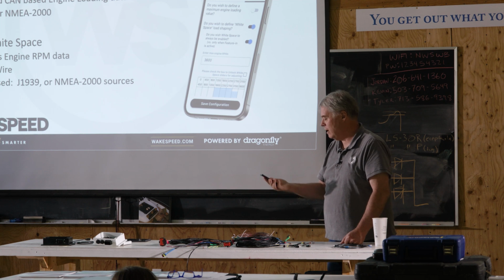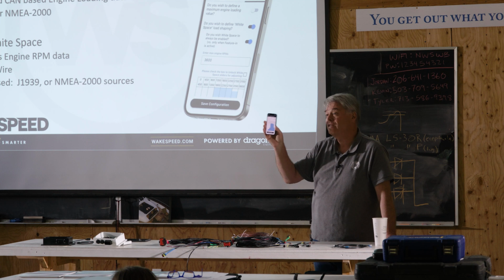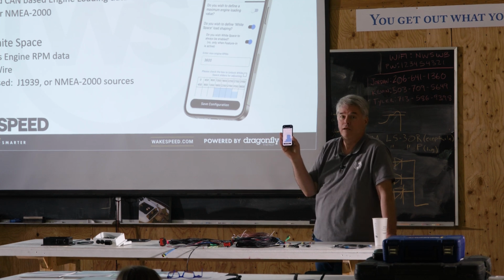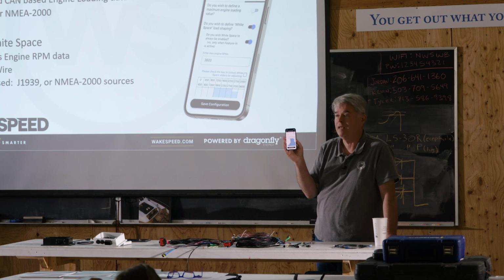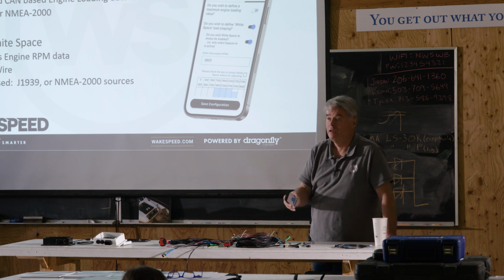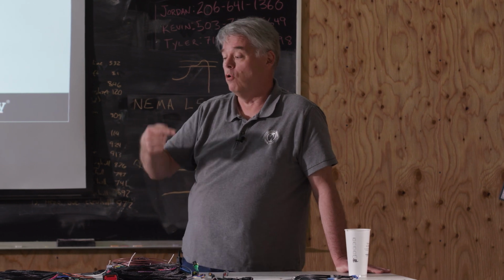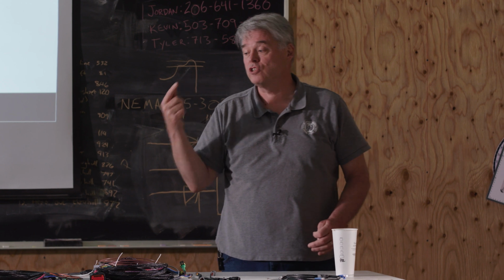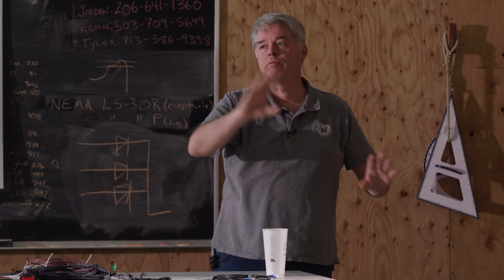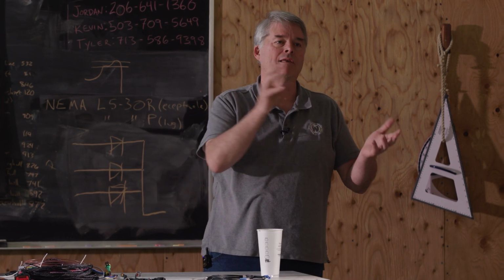And what this means, like here, I'm showing 10% for the lowest RPM. This doesn't mean that the regulator only drives the alternator at 10%. What it means is it's only going to let the alternator produce 10% of what it thinks it should do. It's an overlay. This is kind of a struggly concept, but there are reasons for it. So if the regulator has decided, because of all the input, that it should drive the alternator to 90%, we'll only let it go to 10% of that. We'll only let it drive to 9.